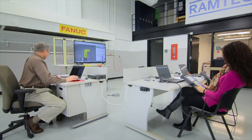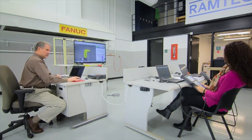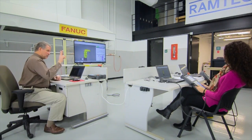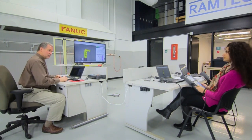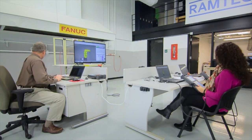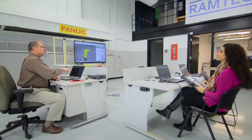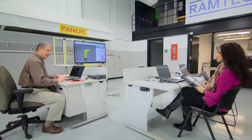Page 65: now we're talking about the coordinate systems, which we briefly discussed before and are now actually going to start doing. There are a total of five coordinate systems. The two we're going to focus on in this lesson are joint jogging and world jogging. Joint jogging is just what it sounds like — flip to page 66 — it is probably the most efficient method of jogging the robot, because it allows you to move each individual joint to determine the desired position for whatever the application is.